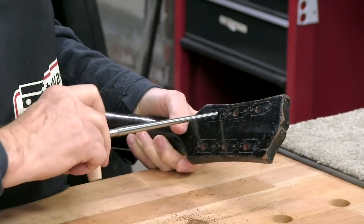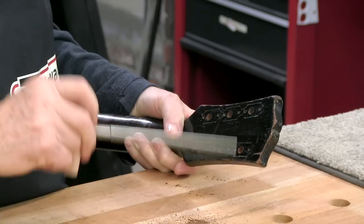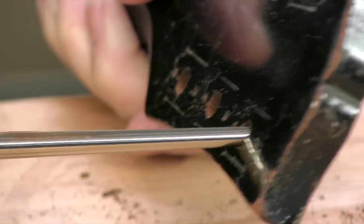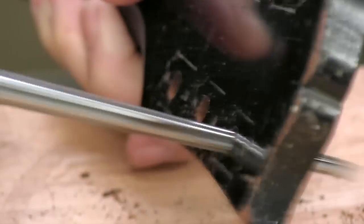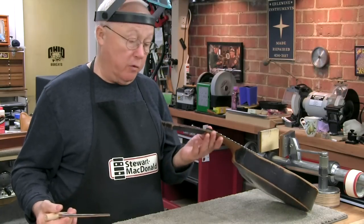The standard reamer fits holes up to 3/8 for violins, violas, and flamenco guitars. The larger reamer reams holes up to about 5/8 for guitars and cellos or whatever hole you're trying to patch. The small reamer is perfect for this mandolin, for example.